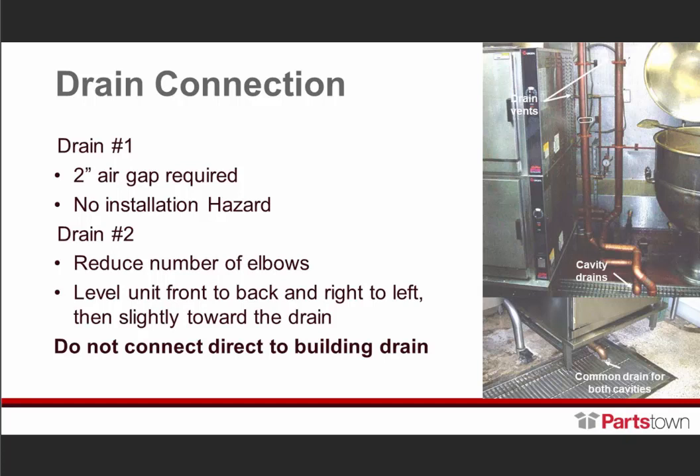As shown in this photo, this is the same issue as the floor drain — this is actually drained out towards the front of the unit. I understand that some installation situations are more challenging than others. Give us a call and let us help. In most cases, we pipe and manifold it back down the back of the unit out to the drain, which is far from where the operator will be and is a more secure situation.